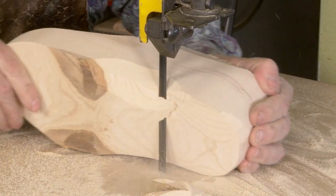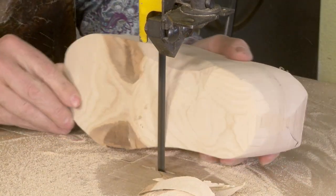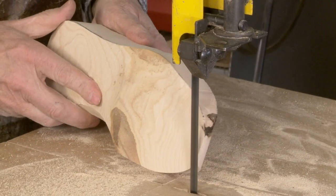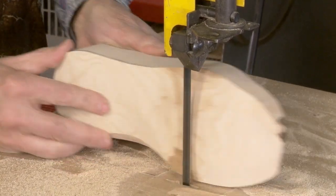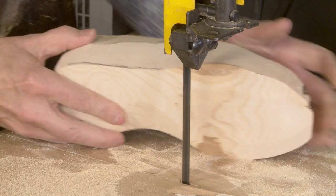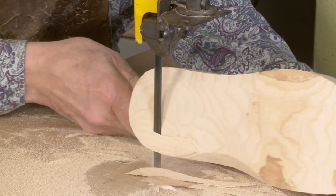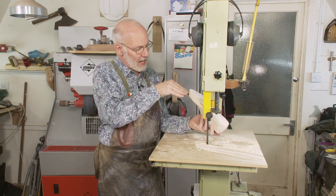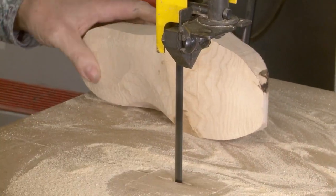The range and the arch support, the range is where the flat surface of the front is. That needs to be skimmed and round. So you see as I'm cutting, gradually the bark disappears because I'm making the crown, that is the round shape of the range of the front of the last. So it's curved in many directions. I'm also making it so when you look from the end, it looks straight, even though it's a dynamic shape.